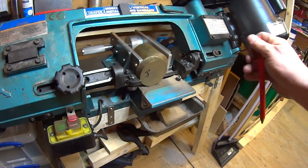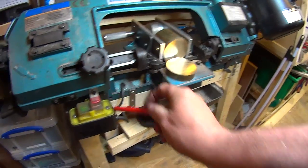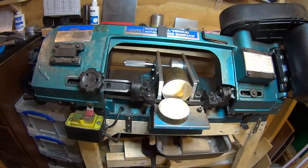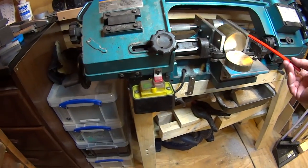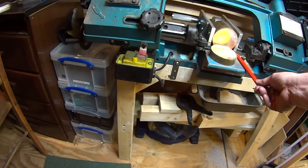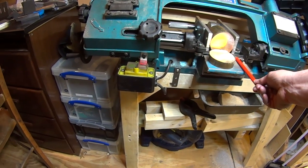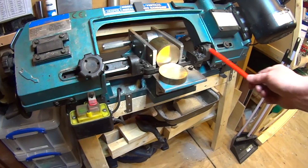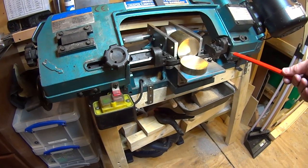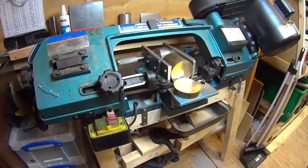It's just finished, and as you can see it shuts off quite nicely as it pops down. There's a nice piece of 3-inch brass just cut — that took about twenty-five minutes. I've also bought a brand new Starrett blade from Tough Saws, recommended by Tom Howe. I think it's a 12 to 14 TPI — it's a good blade, and as you can see it leaves a beautiful finish.